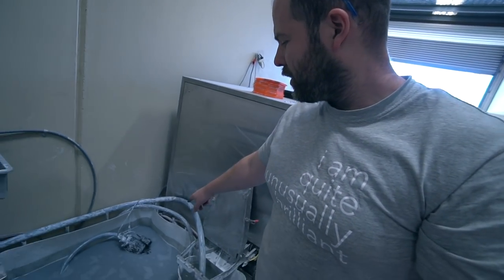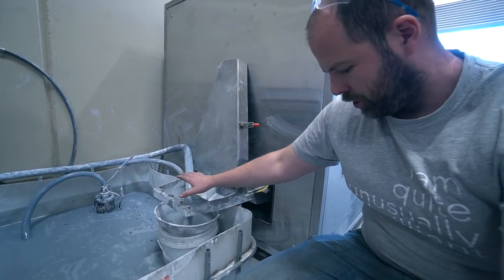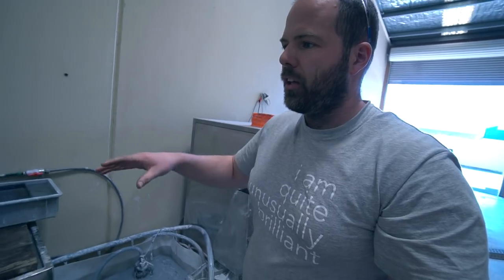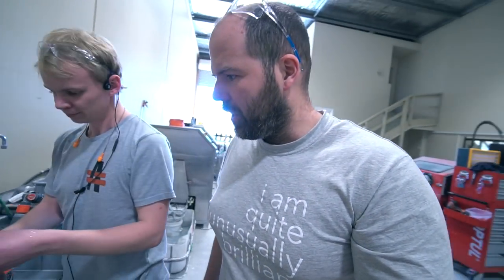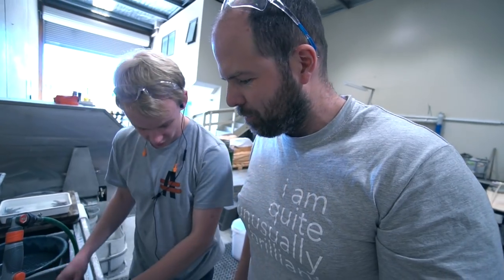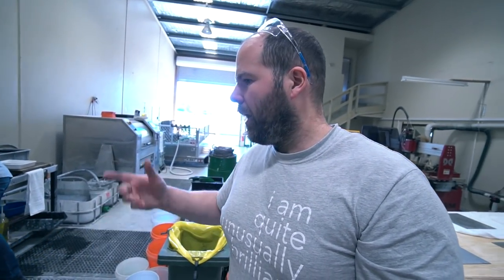It's a little bit different because it's from all of the trays. When we put the different media through this machine, it all flows out here, and we end up with a pool of basically just bits of all the different types of media in the bottom. The other day we had a big clean up — Brad cleaned it out, put the bag in the trailer for the dump. Someone on Instagram said to see what the finish is, so we're doing a test. We've got all sorts in here — rubber, leaves, bits of plastic. We'll do a half-hour tumble with a part and see what finish we get.